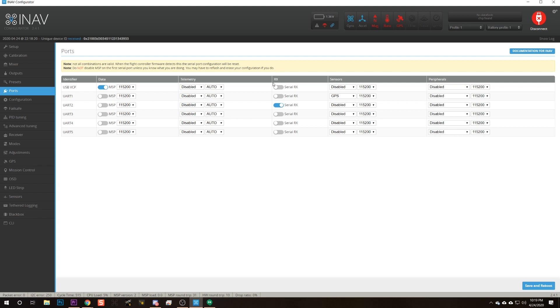The receiver is enabled on a UART by enabling Serial RX on one of the UARTs. In this case, it is already enabled for UART 2, which if you're using SBUS or most receivers out there, is going to be correct. You'll need to check if you soldered your receiver to a different UART number — the most common case is a Crossfire receiver, which is probably connected to UART 5, TX5 and RX5. But most people will have the receiver on UART 2, so Serial RX on UART 2 is already correct and we don't even need to hit save and reboot.